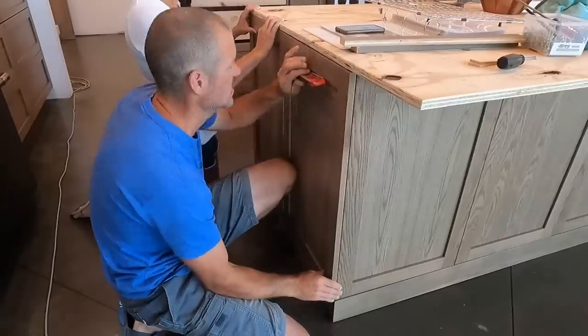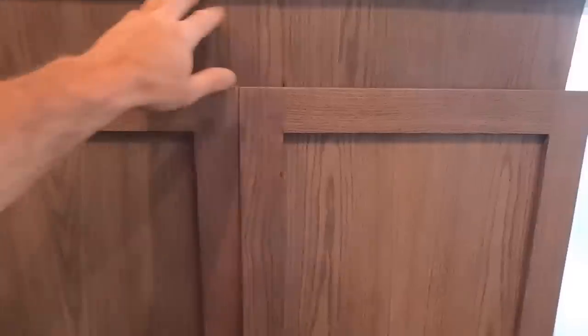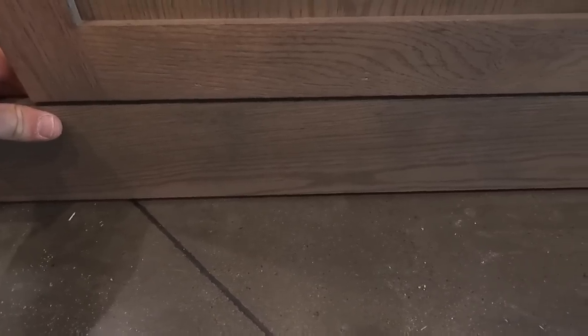We are going to start the trimming process here in the kitchen, starting with the island. In order for me to finish all the electrical I need to have these deco doors put on the ends — it's basically two door frames that make it look like doors. Emily and I are going to put these on: we just square them up and trim-nail them in, then fill the holes with filler and you won't even see them. The trim will go down here, and there's also a scribe molding we can put along the bottom if needed — we might have to use it because the island wasn't perfectly level and I had to space it off the ground on one end.